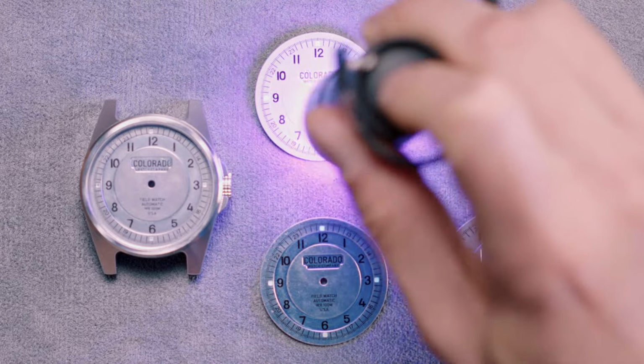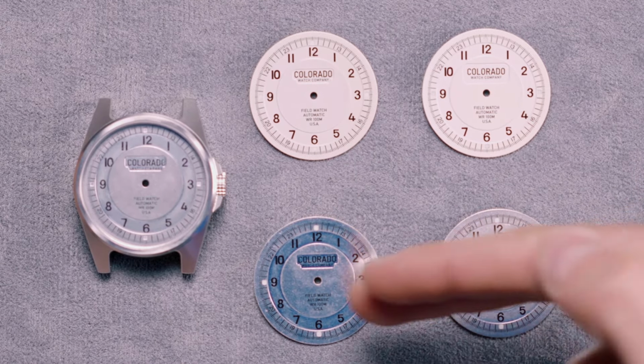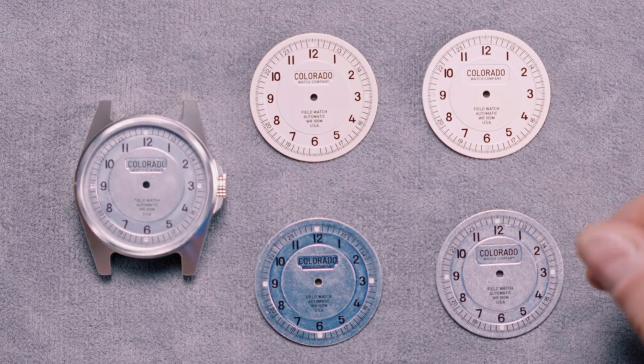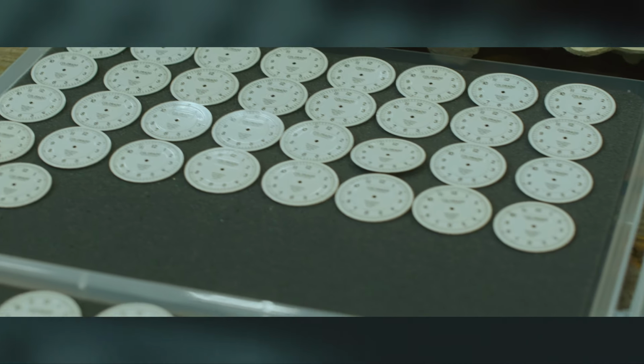These have also been loomed. And it's a little hard to tell in this light, but I'll show you as best I can. Again, these are metal, aluminum, that have been barrel tumbled. And then these are coated with white. If you recall, probably 5 or 6 episodes ago now, we were trying to figure out electrophoretic coating. And we did figure it out, but it's very difficult. It's almost impossible to turn something white. And if you look really closely, these are not what I would consider white. They are more cream. They're beautiful.